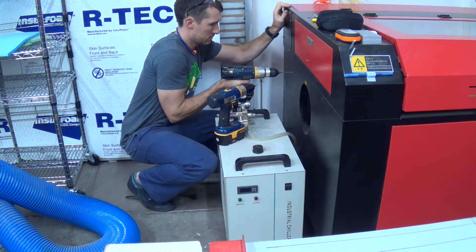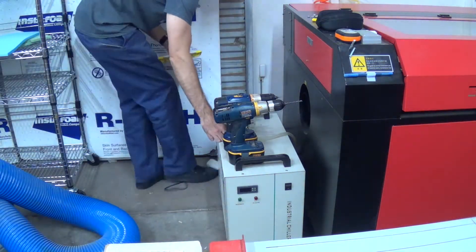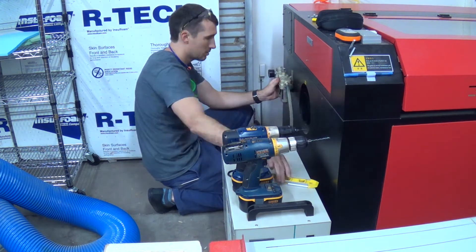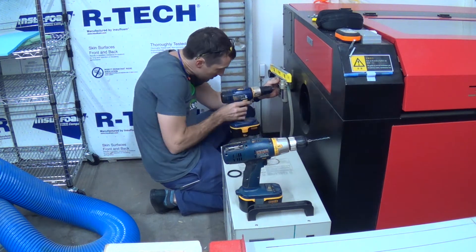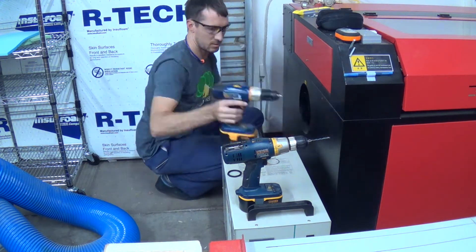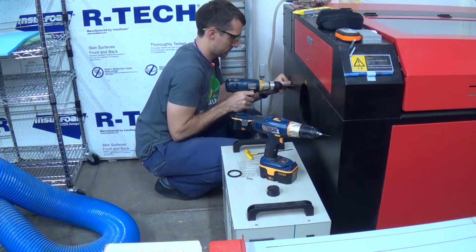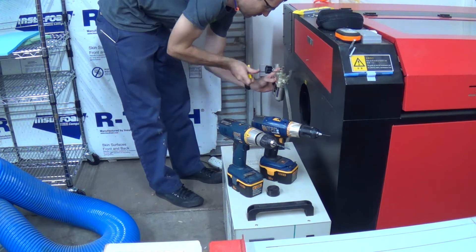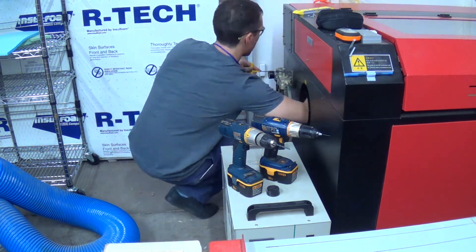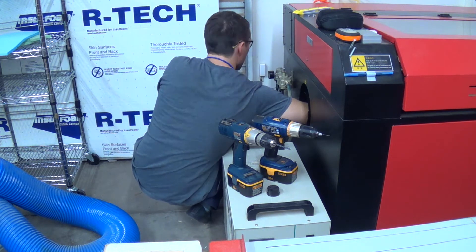My original plan was to rivet the regulator, filter, and dryer assembly to the side of the laser cutter cabinet, but instead I went ahead and used some 10-24 button head cap screws and lock washers, mounted on the inside of the cabinet. This area is pretty safe — I can stick my arm into the exhaust hole and feel around in there. Towards the back is where the water and air supply lines come through, but I had already reached through and checked to make sure I had clearance. After doing the first pilot hole I made sure I could level it, and since the drill didn't reach I just took my Allen wrench and scratched the paint to mark my pilot hole location, then drilled the pilot hole and made it bigger for the 10-24 bolts.